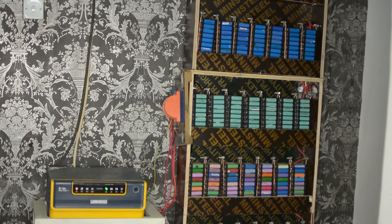I processed the batteries and made them into a full 24-volt system. I decided to use 24 volts because I have a 24-volt inverter, and it's most suitable for these batteries. With 12 volts you might have problems — connecting four in series gives a lower charge rate, while three in series might overcharge. So 12 volts is not really ideal, and that's why I went with 24 volts.